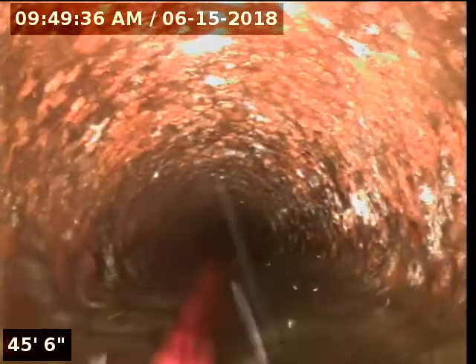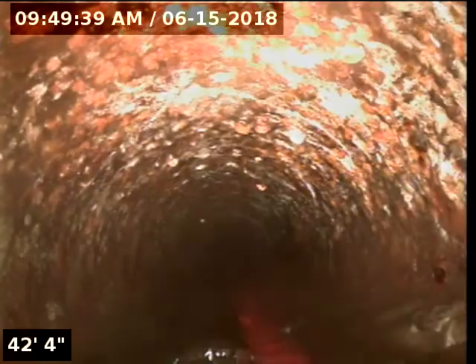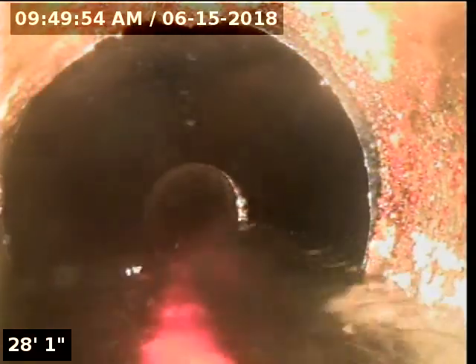It's pretty scaled up there. We were able to get the shaft all the way down. Even though that bedroom was locked and the clean-out is gone, I think we're going to be able to get this thing good enough with a little more work. There's the clean-out, there's the backflow valve they removed. You can see it just pumping around in here. I'll pull it back through again and make one final video.